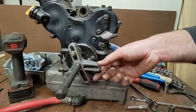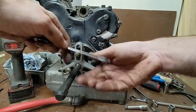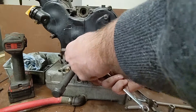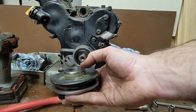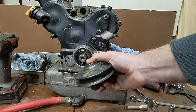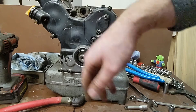I'm going to take this out and pull that apart — it slides right off. Here it is. I did have this little roll pin here that helps line it up with where it needs to go. So there's your pulley off. Now that this is off, we can pull this timing cover and go from there.